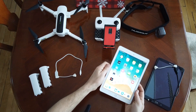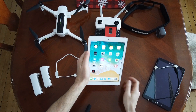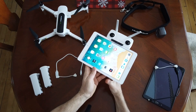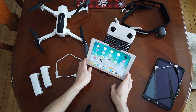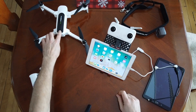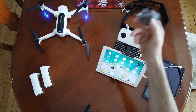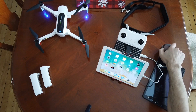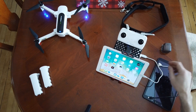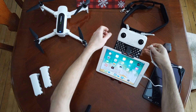OK, so now we have it all updated to the latest operating system. I'm not going to update the app yet, because if this works we want to make sure the OS is why it works. So let's hook her up, plug in, turn on the quad — remember to always take off your gimbal cover — let's turn on the controller, and we'll plug in the TX end to the controller.